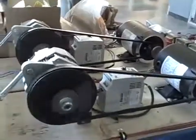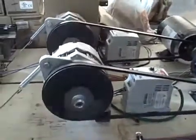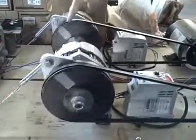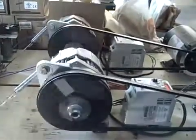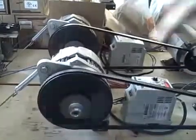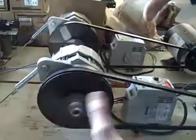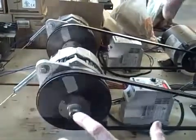I've just closed the breaker, and now we see these two generators spinning at exactly the same speed. We have a piece of tape there that appears to be stationary, and a piece of tape here that appears to be stationary — we chose to lock them in in this orientation. We could have chosen any other orientation and it would have worked just as well, but here it's easier to see the two pieces of tape pointing in the same direction. It's a more dramatic effect.